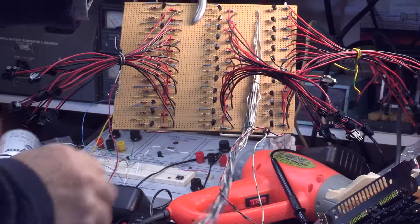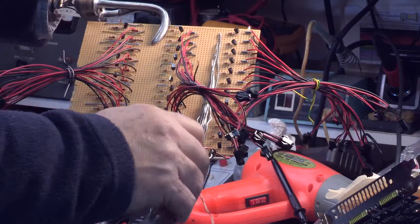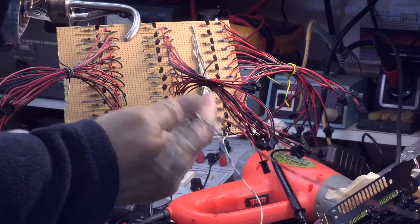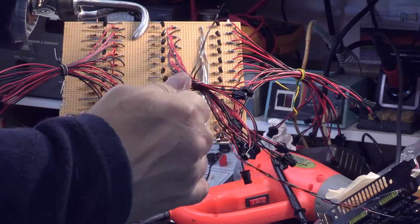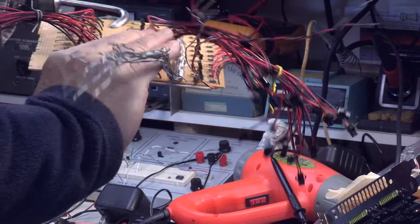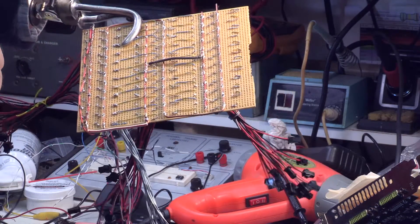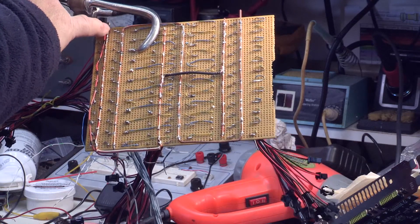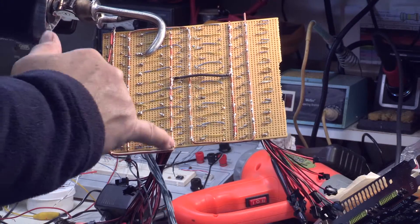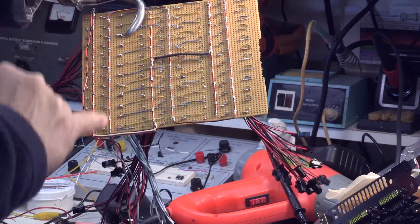Here's the finished board. We've got three rows of connectors for the LEDs, 12 signal lines from the Arduino, ground for the Arduino, and 12 volts. I didn't really plan this out — I just kind of made it up as I went along. What I used was the ground wire from the 14-gauge wire I used for the LEDs to run the rails. This is the 12-volt rail here, comes across, and this is the ground rail.